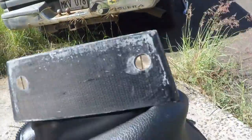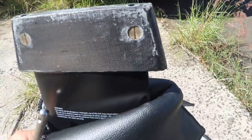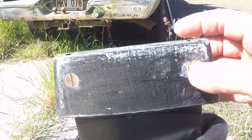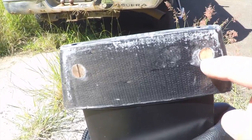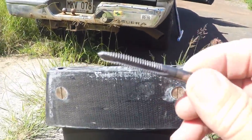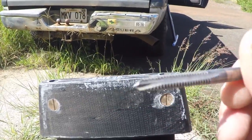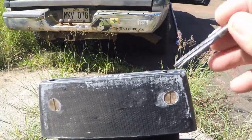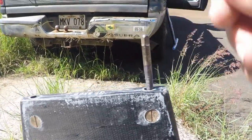This is a little video on how to tap your bolts. Say these are metric threads — this is called an M6. What we have here is a tap; this is a quarter 20 tap. So say you have the wrong size bolts for your board and you want to switch it to an American — you get a quarter 20 tap at the hardware store and you run this through it.